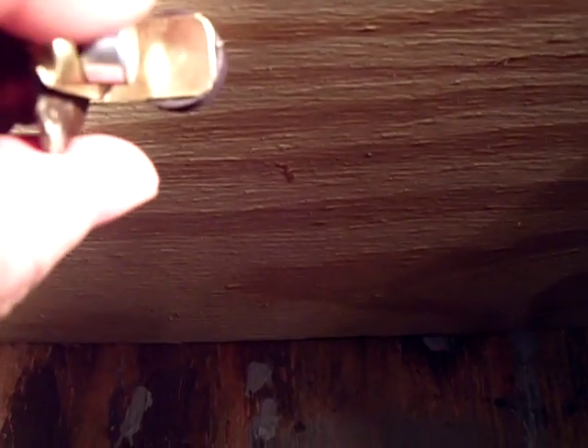I need a little adjustment - the adjustment is in the drill itself. What's going to happen is this system goes around and comes close to the magnetic proximity switch, and it counts on the counter. I'm going to actuate the drill here. It's hard to see the LCD but hopefully you can see it counting up. Here's the magnetic switch here.